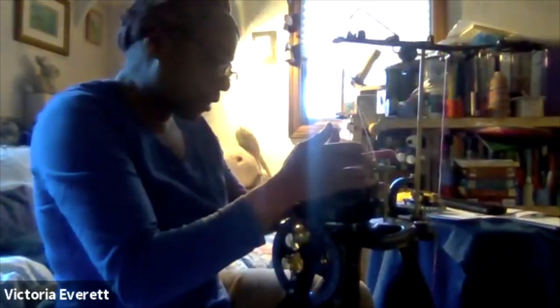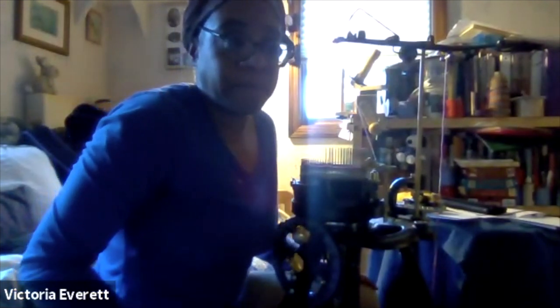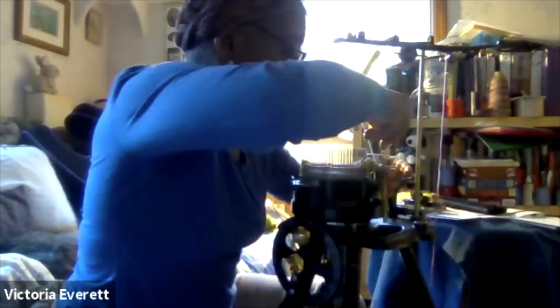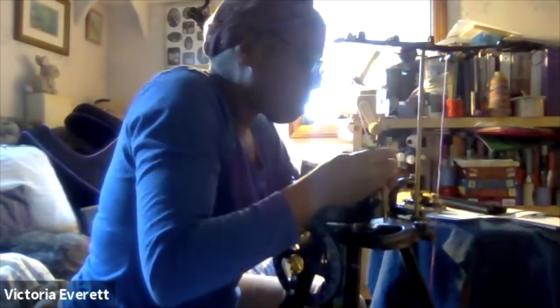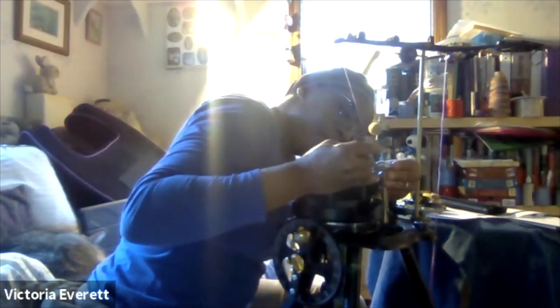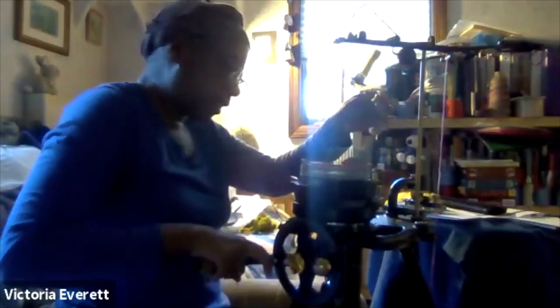So it just needs a smidge in. Oh, that's an end zag. You need your yarn to be close to your yarn carrier, close to your needles. You want the yarn to be delivering almost right into the latches, at the base of the latch. All right, I pushed it in. I haven't tightened it. I want to see if this is going to work. So you want to tighten it?